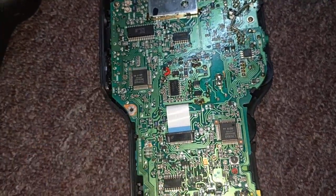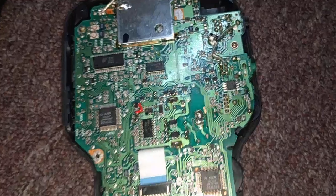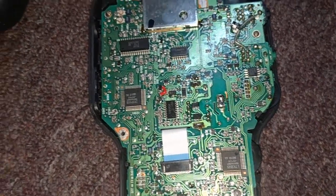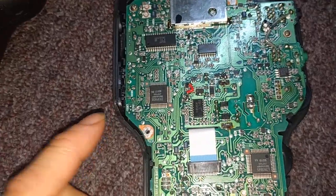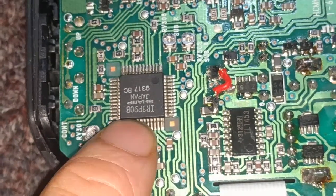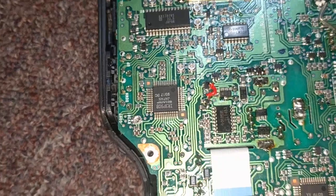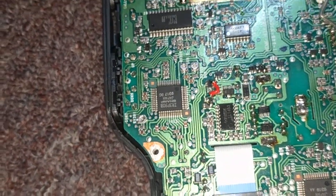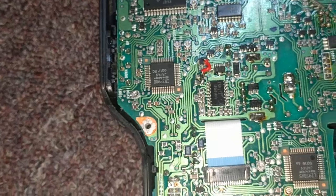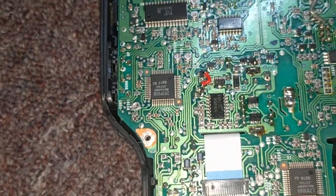Why do I like this thing so much? Aside from the retro screen quality without ghosting and other artifacts, it's got a very nice audio amp — a Japan Radio audio amp that just makes a really pleasing sound. And most importantly, it's got this IR-3P90B Sharp chip. This is part of the Sharp TFT decoder chips. Not only can you really fine-tune them with trim pots and all sorts of stuff without needing to digitally reprogram anything, it's kind of an analog television in a way — a cool mixture between analog and digital. You can do a bunch of analog controls on it, which is really cool.